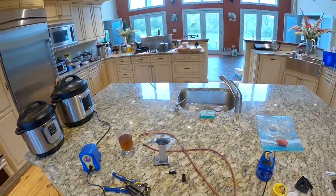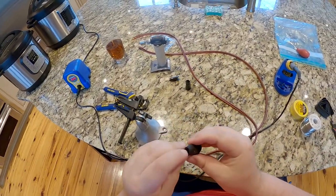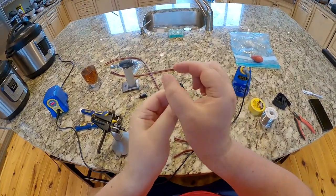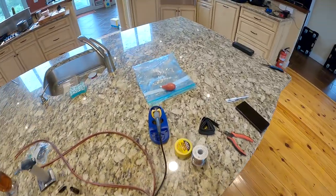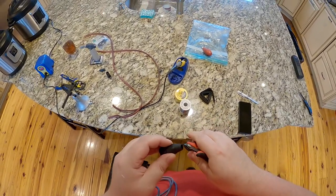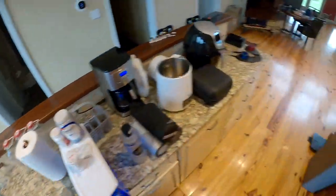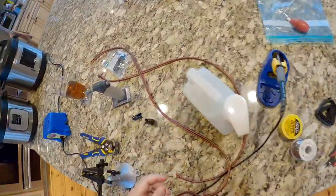I may have to get some lube — and I'm not joking — not joking lube, like actual lube. Because I don't want to cut this; I could cut it a little further back. But see — it's not conical. This tube in here doesn't flare out; it's solid all the way to here and then it gets bigger. So I'm gonna see if I can lube that. I'll try some dish soap — just a touch — something I can rinse off after, since we're gonna slide this down the wire. I don't want to do anything oil-based.